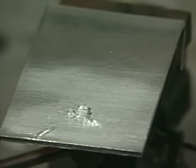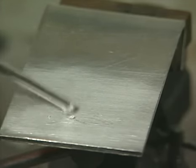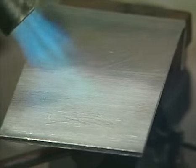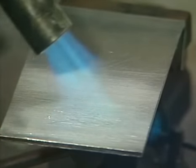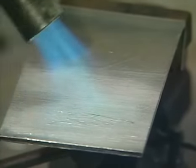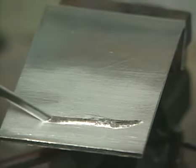It is essential that the heat from the workpiece melts the rod. This is the only way you can ensure that the technoweld and the aluminium are at 380 degrees centigrade at the same time. Molecules of aluminium start to leave the surface at 380 degrees centigrade, and the technoweld grabs these molecules to start the process. If the technoweld is at 380 degrees centigrade before the aluminium, it has nothing to grab.